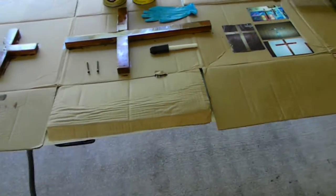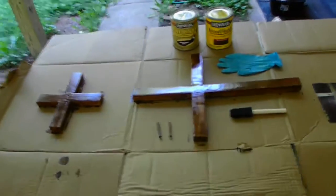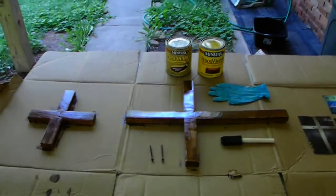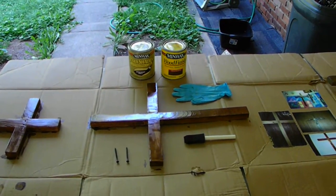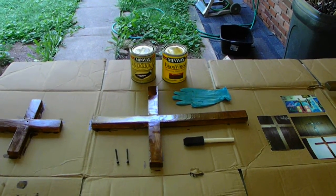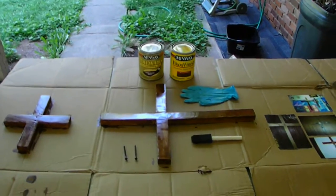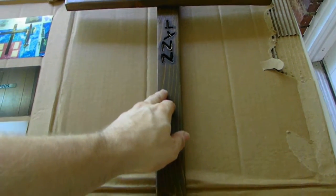I will not be staining this anymore. This will be the last stain — I only stained it two times. The more times you stain it, the more the wood is going to look darker and uglier. With darker stain, of course you have light oil stains and lighter woods. This was a light wood; that over there was a dark style wood. You can see how this one came out beautiful with all the grains.